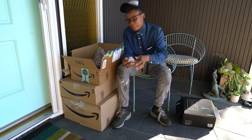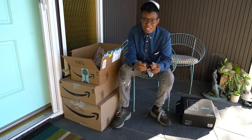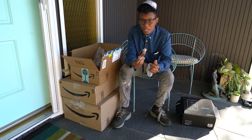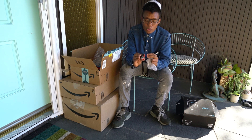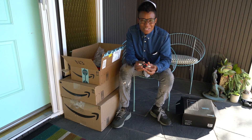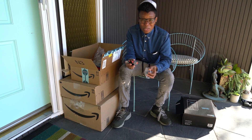Inside this box I have this guy. I purchased a series of breakers at different amperages. This is my 40 amp breaker and it protects my charge controller from any huge surges that may come from my solar panels. This breaker will hit the switch and disconnect my solar panels from my charge controller if something over 40 amps surges through, trying to make its way to my 40 amp charge controller.